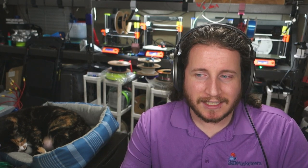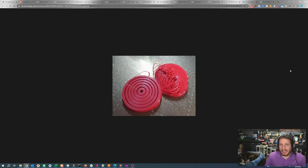But let's get back to helping out Sundy, who does definitely have the right nozzle. They're running PLA 850 with a 210/60 setting — 210 on the hot end, 60 on the bed. 210 for PLA with a Diamondback is way too hot; you normally want to be in the 190 range. We've run lower than Prusas will let us run and still had pretty decent layer adhesion because of thermal conductivity — it matters that much. While they're using the stock build plate, what we can see is that some parts shifted or got knocked off the build plate, and the first couple of layers got knocked off as well. We asked them to check that the Y-axis or X-axis belt wasn't loose and that the grub screw wasn't loose.